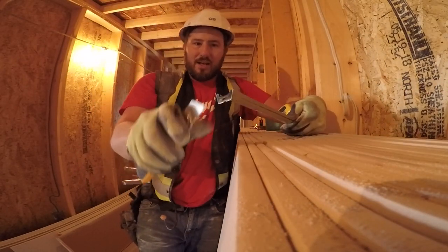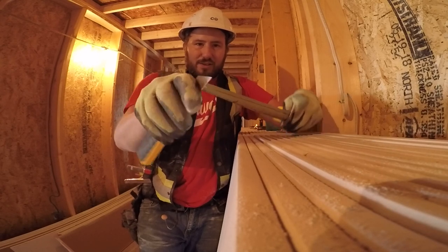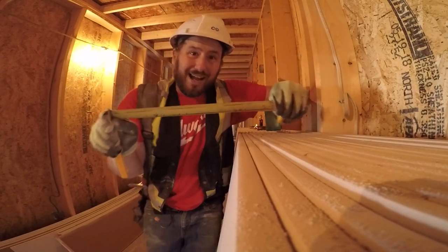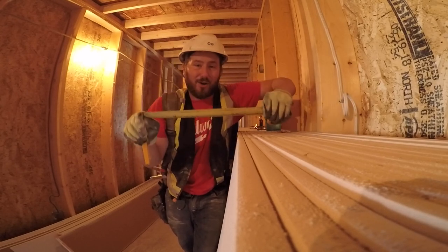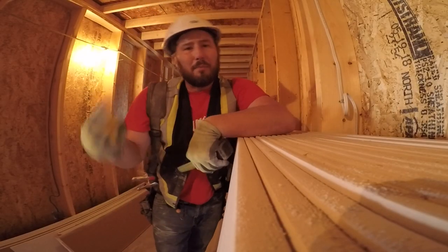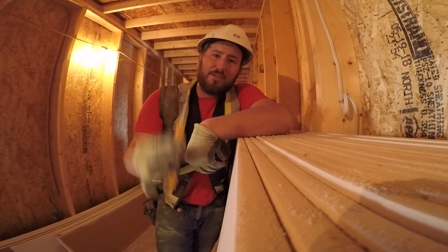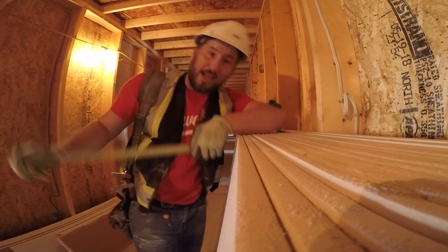Take the knife end and your thumb and clip it onto the tape. When you find your mark it's important to keep it nice and solid — the grip, don't let go. Use your knife to make the marks on the drywall so you don't have to use a pencil, and you always have your knife in your hand and your tape measure for that matter.